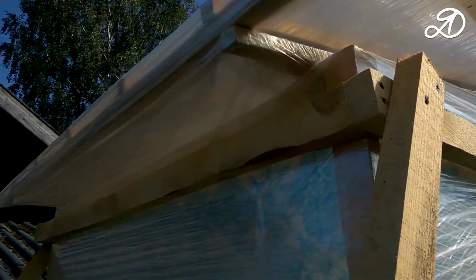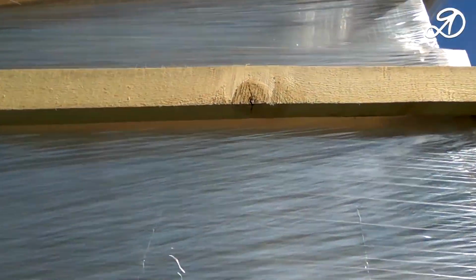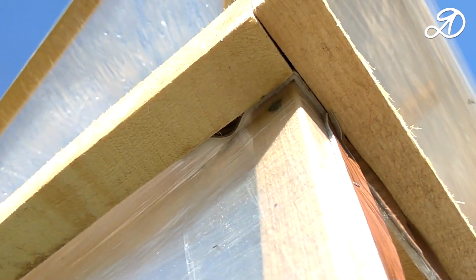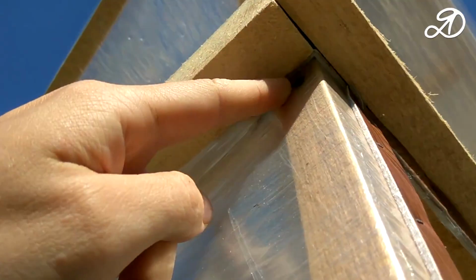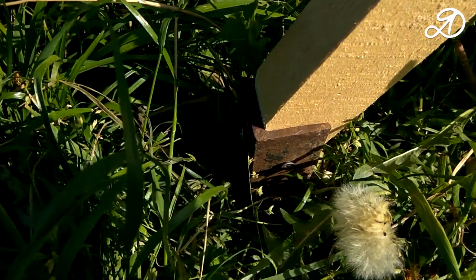The design was very light, and it is important that it is not carried away in a strong wind to the neighbors. I don't want the shower to change its location without my knowledge. In the upper part of the shower on the perimeter I made additional strapping timber. In order not to damage the film, I provided spacers of linoleum. In the ground I hammered iron L-shaped profiles.